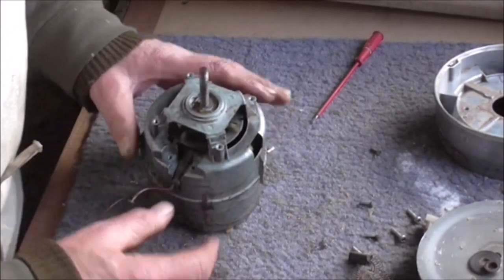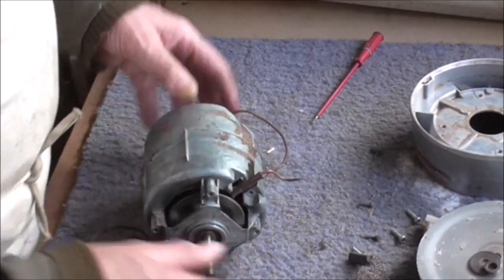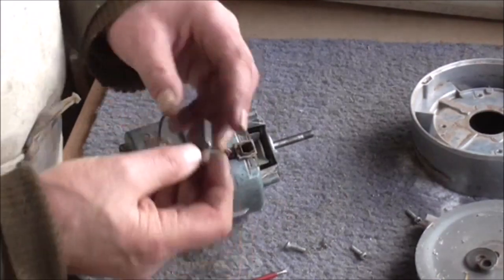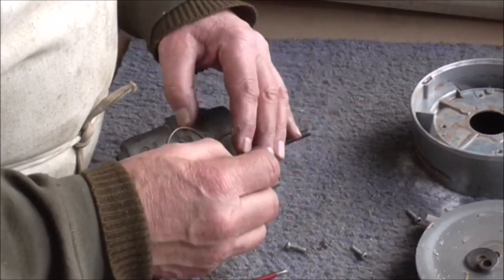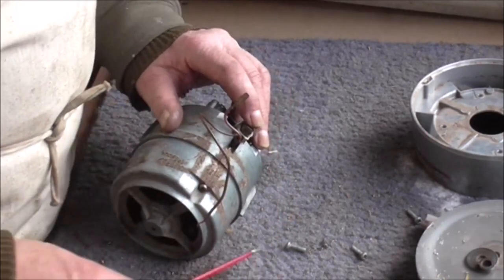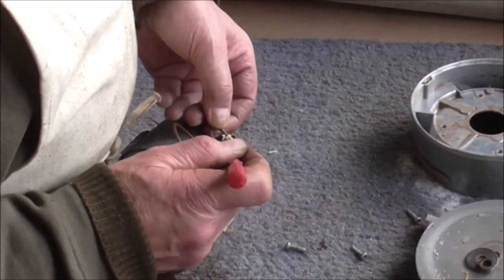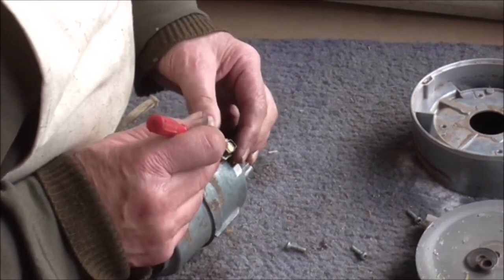That's the actual motor part done. I've got the carbon brushes to fit, but that's fairly straightforward so I won't film that, and then it's a question of assembling the end cap. The brushes can be a bit fiddly to get in, especially these with a spring with a wire in. What you want to do is push the brush in, then push the spring down with one hand and hold it in with the other. Get a little screwdriver, press it down, then poke the little tab in like that to lock it in place. Make sure that little tab is pressed up to stop it coming out again - and that's the carbon brushes fitted.